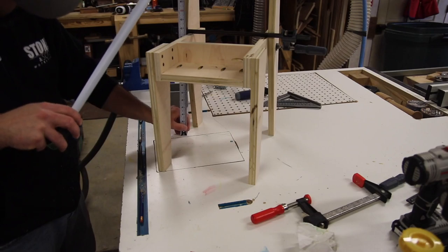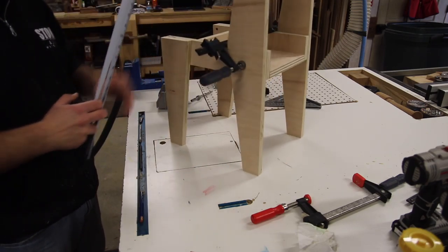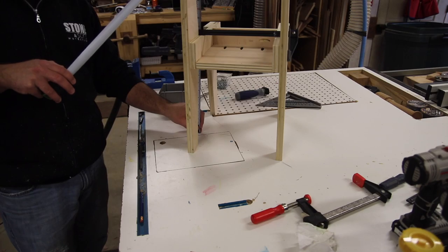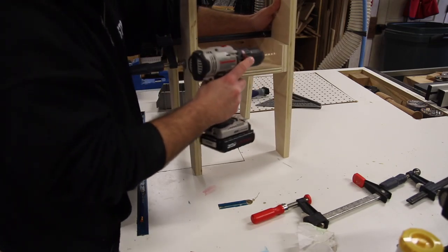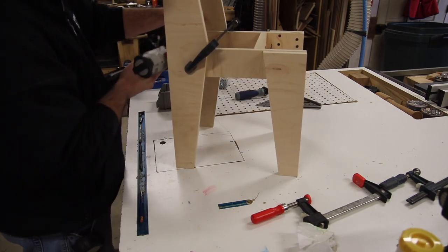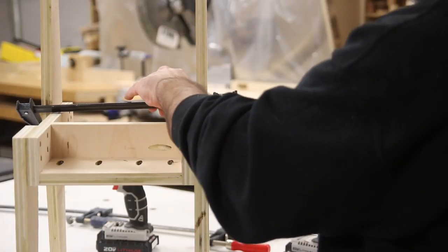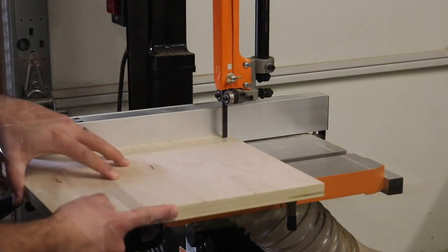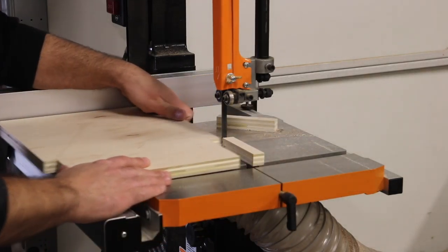The chair back is also tapered. I attach the legs, make sure everything looks good, and then attach the back legs. The back legs and the chair upright for the seat back are all one piece, so I had a taper on both ends at different measurements. I had to measure first, taper, then measure again to make sure I had the seat portion level. When I had it just right, I went ahead and attached the back legs.